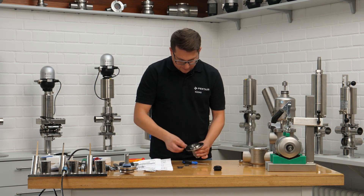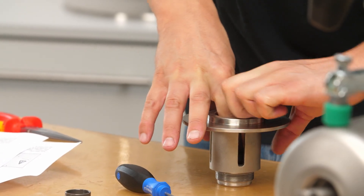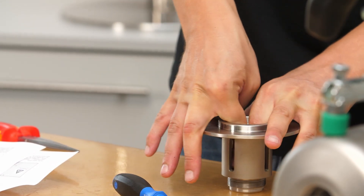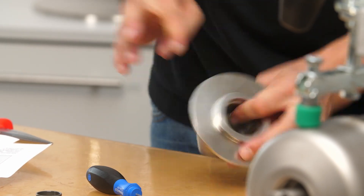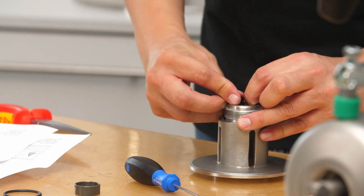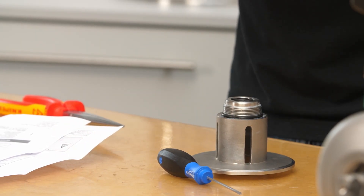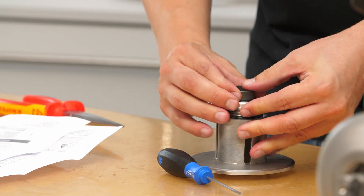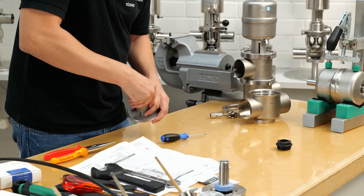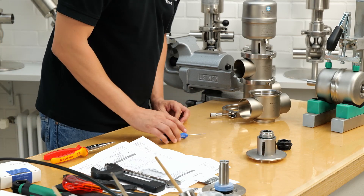Let's start with that one. As longer your fingers, the easier it will be to do it from that side, but you can also try to push it in from the other side. Then the o-ring in the groove up here. Then the outer side — the guide: squeeze it together and then push it in. When it's right positioned, you will notice a click.